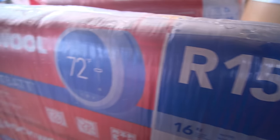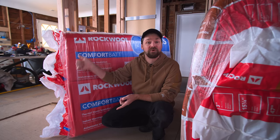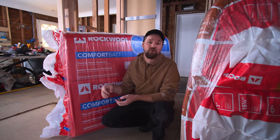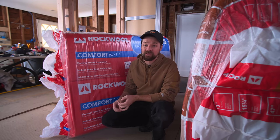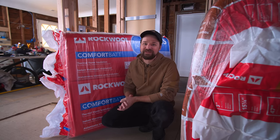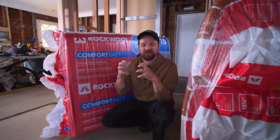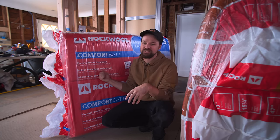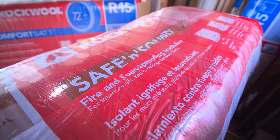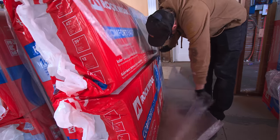product a lot, not a sponsor, but I do appreciate that it helps cut down on noise. We have a pretty busy street out front, and it'll cut down on a bunch of that noise. It's also moisture resistant, which fiberglass is not. Old house like this is probably gonna leak a little bit here and there, and the problem with the fiberglass is that it'll compress when it gets wet and it won't bounce back. This stuff won't do that. It's also incredibly fire resistant, so this stuff is made out of rocks, so it does not burn in any situation.